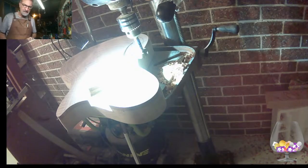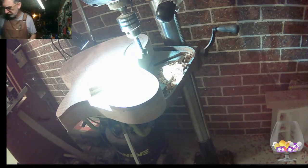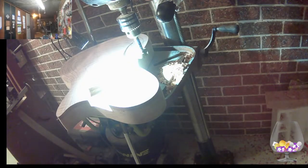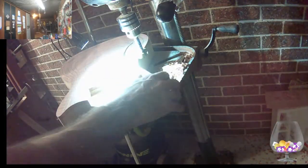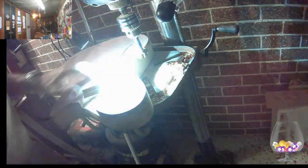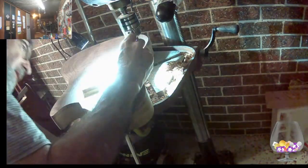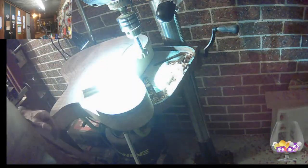Okay, there's our guy. The microphone is on. Let's go and drill those holes. Pilot holes. We need to come down 20 millimetres. Actually, a little bit more. 25, I'm going to come down. 25 mil. So let's measure that down there, the 25 mil mark. I've got markers on that drill. 25 is at that second line. That's good. I know where that's got to go.